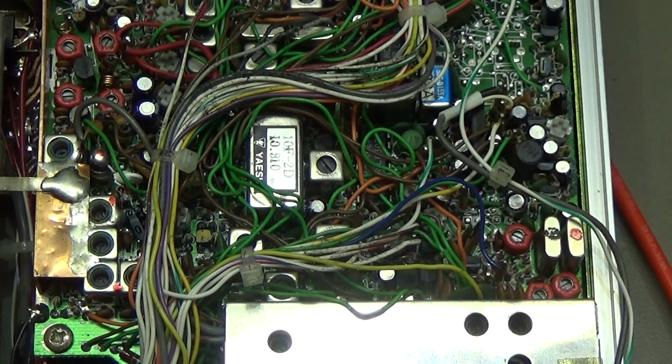But when I take it out, in that moment we directly have, as we have just seen, our full output power, and output power is on the right frequency which is dialed in here with our frequency dial. So you see we have something wrong in the ALC stage, but it is not our ALC DC amplifier.